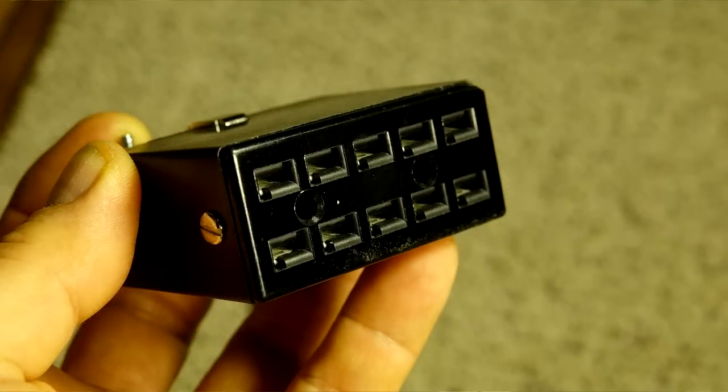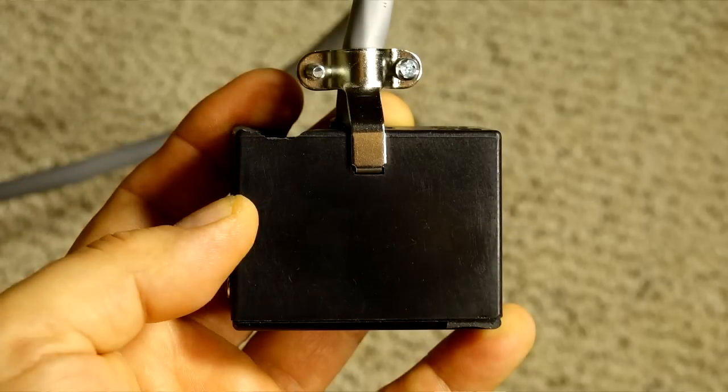These two are connected by a multi-conductor cable with a multi-conductor pin connector on the other end that goes into the RF deck — possibly proprietary, but it doesn't much matter. It's a fairly thick cable and it is six feet long. Now, 60 watts of drive is going to drive this amplifier to full power output, which is over 600 watts. It varies on each band just a little bit, but it's pretty darn close — the amplifier really does deliver as specced.